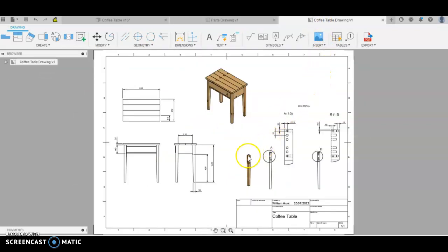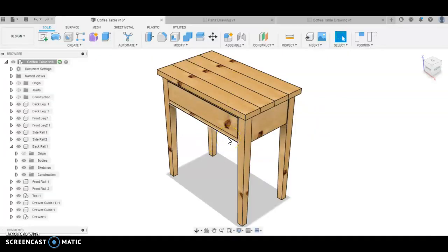This is our working drawing as well. I've got two details here — an orthogonal projection with three views to show us the main sizes of all our components as they're assembled. And I've got an individual orthogonal drawing here — a single view of the front leg and also the other front leg on the side view, with two detailed views showing a few more details of where to mark out those dowels for the legs. In the next few videos, I'll show you how to create this the easy way using all the different components we need in woodwork.